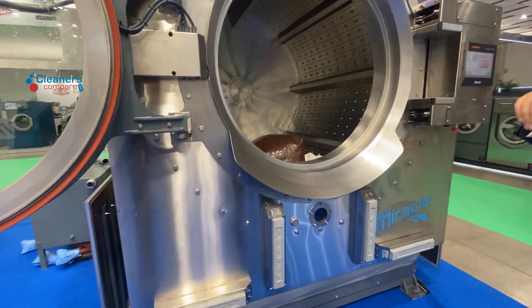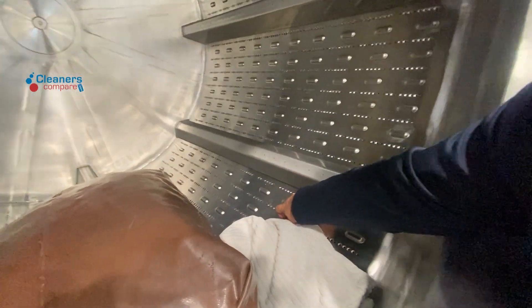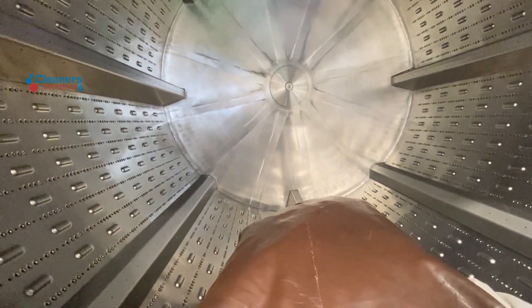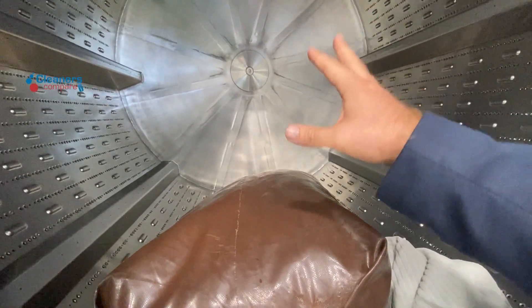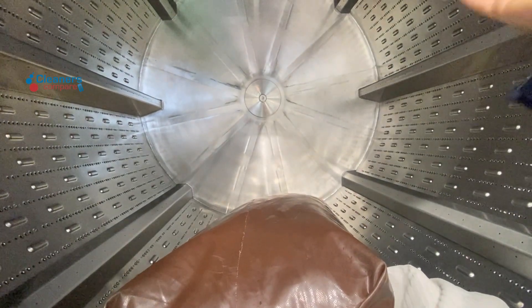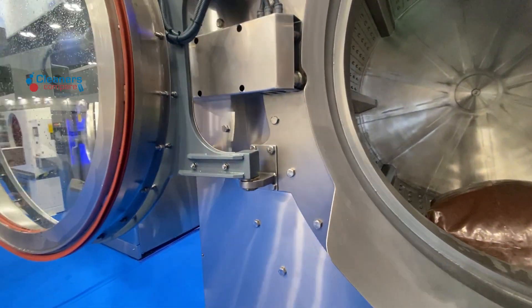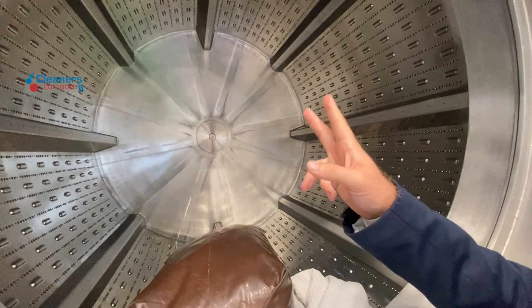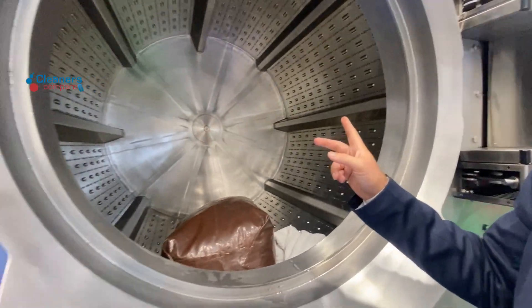When you compare to other machines, almost eight times less water is used. The perforation is very low, so the aim is to limit water passage to the outer drum. The principle is that we intake water and keep it in the inner drum — the active area where the textile is. Normally you take four liters or minimum three liters of water per one kg of dry linen, but in this machine you can go down to one-to-two, or in some cases one-to-one: one liter per one kg.